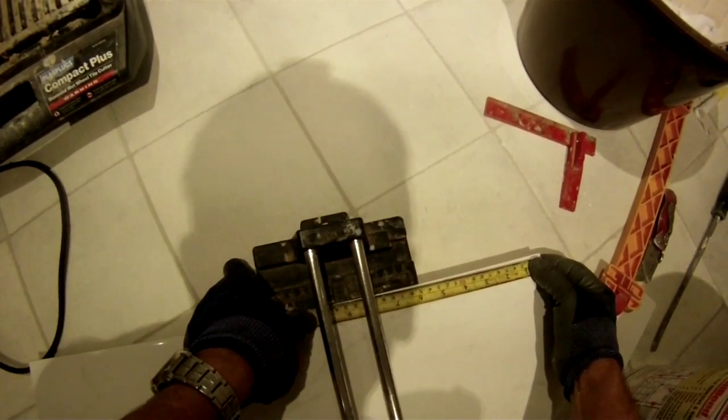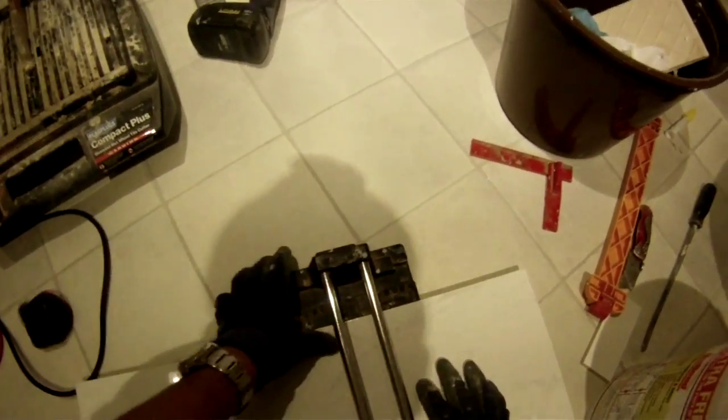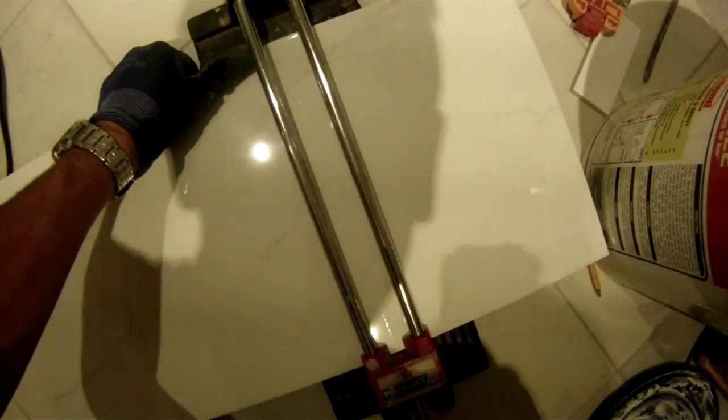There's more tiling to do. An alternative way of measuring tiles is with a tape measure — run it across to the edge, allow a little bit of a gap for grout, so 23 centimetres. Go up the top, see if it's straight, and measure all the way up — in this particular case it happens to be vertical. We very quickly knock off some 23-centimetre-wide pieces of tile using the same tape measure. Since these happen to be dead straight, all we've got to do is butt our tile against the end of the tile cutter for a straight cut.